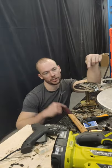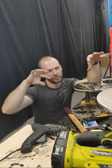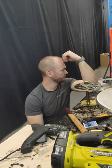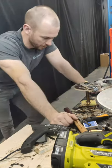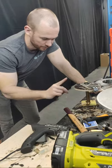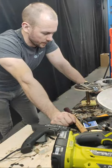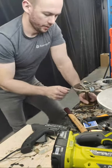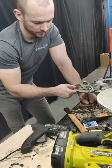Of course, you could do something like an injection molding machine. You could have a feeder drill bit, which is just feeding pellets out of the end of the extruder. But I think that might be too complicated for this. And again, it's a servo, it's not a motor, so we're not going to be turning constantly. It's going to be moving like this. That's the servo movement, about 200 degrees. So the idea is that we just move back and forth, versus if it turned, you could continually make a mechanism that things just drop through.